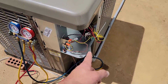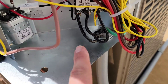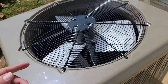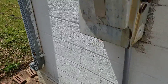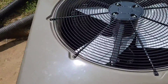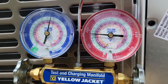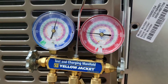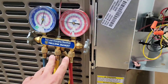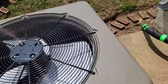Let's go ahead and switch the power here and turn it back on. All I did was switch two legs of the incoming power. Now we're going to watch what the gauges do and hear what the sound is compared to before. Hear that? That means that you need to switch the phase. Look at what the pressures do — not right. This right here is what a typical unit sounds like, and what the pressures look like, when the phase is not right.